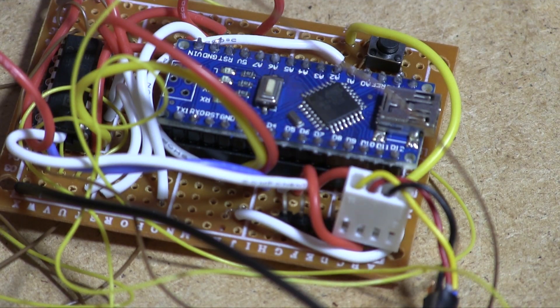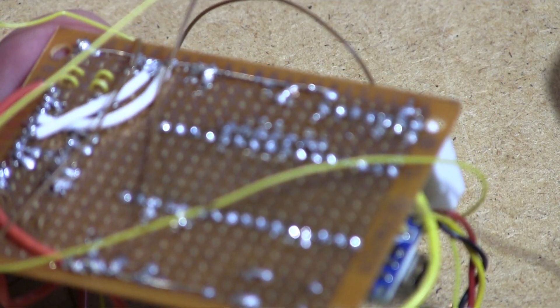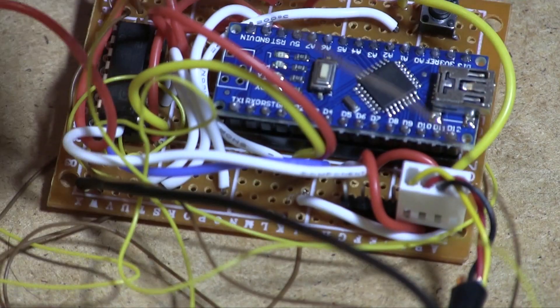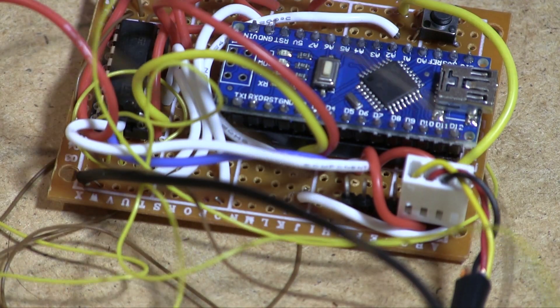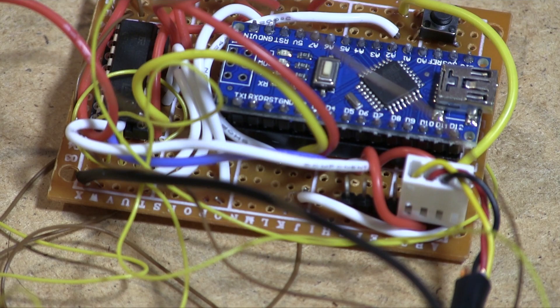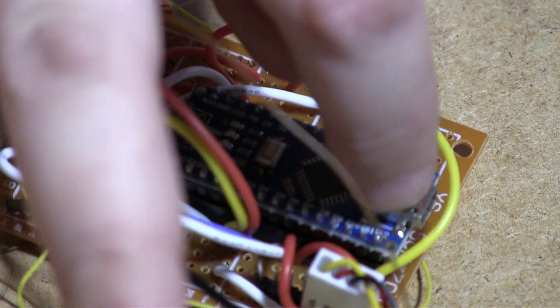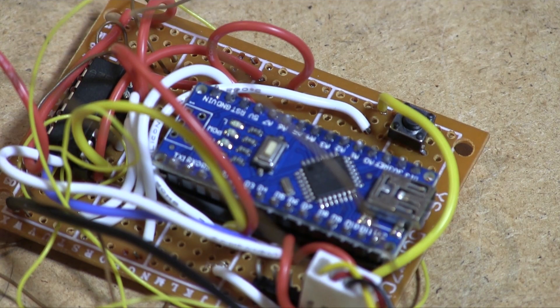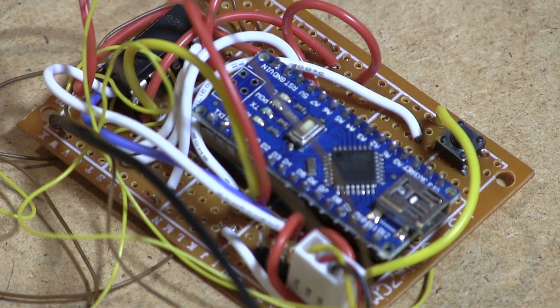It's not a terribly complicated circuit — it's just a circuit with a lot of connections, so you end up with a lot of wires. I try to keep them mostly on the top. The really thin wires I used just because they're easier to solder onto the lens points, but they are quite delicate. I'm currently powering this using the Arduino's 5 volts. I could also power it from the 5 volts the Vectrex sends out, but the ideal is to power it using the actual driver chip — once I can work out what's not being pulled up or pulled down.